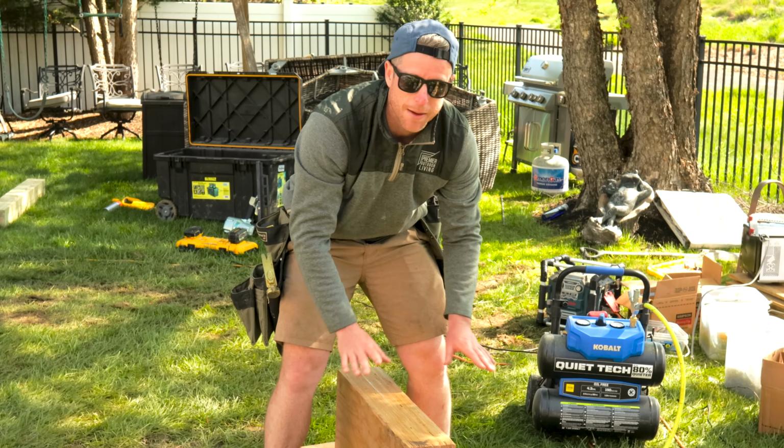Sometimes I'll make a mark at 3/4 just so I have an idea. And then I'll do the whole bottom first. Move the rafters so that your center line is in the middle. Roughly like 6 inches. Okay. So around the edges, you want to be at least six, every 6 inches. Yep. And when you're in the guts, about 8 inches. Okay. I go to the top. Okay. Adjust them. Yep. Now the tops, and then just fill.